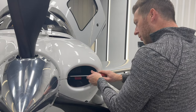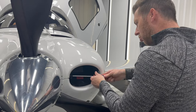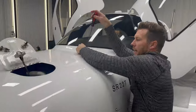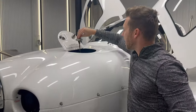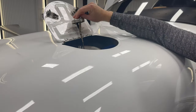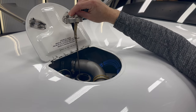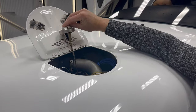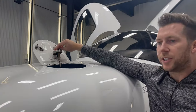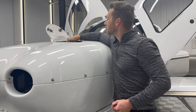I don't believe in impact drivers on any of these screws, so I take the extra time to do it all by hand so you don't inadvertently strip any screws. Every time after I land, I take this oil cap and open it up — Matt McDaniel, my CSIP, taught me that. It allows all the steam to evaporate and come out of the oil filler versus condensating on top of the engine. I do that every time.